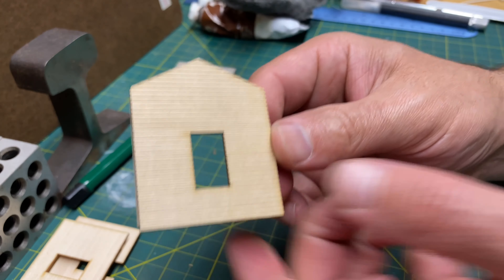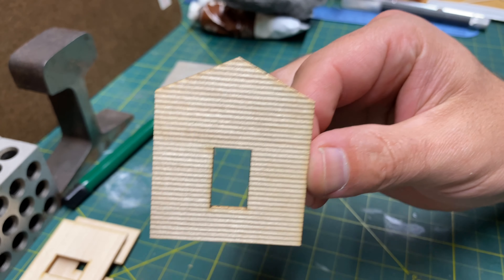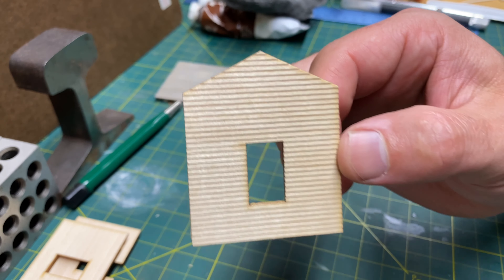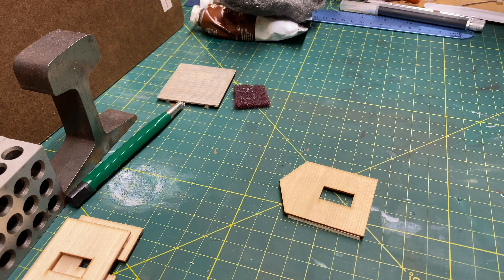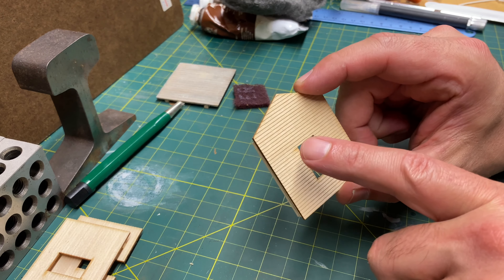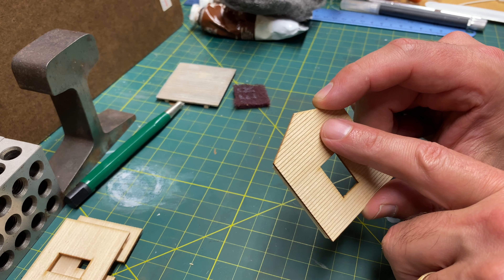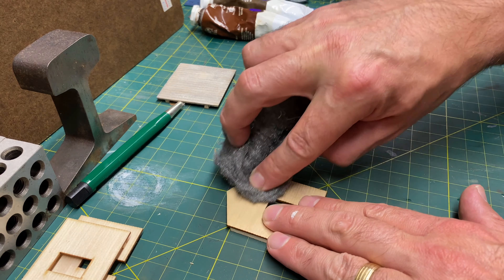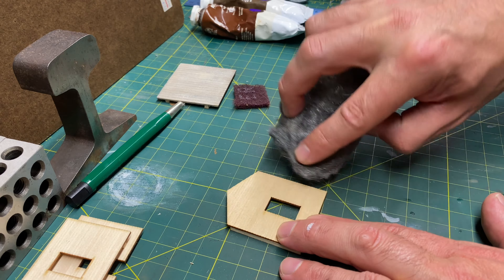Here's a little trick: when you're dealing with wood, especially one-sixteenth inch corner pieces, you're going to get little tiny hairs popping up from the wood. That can be a problem. This is where your steel wool comes into play. Lightly go over the piece with the steel wool and it picks up all those little hairs and brings them off the wood.